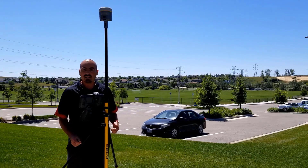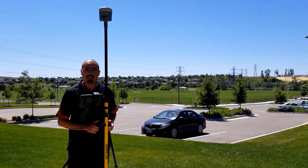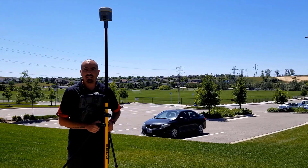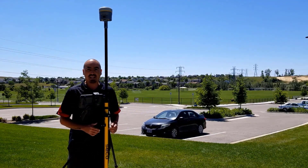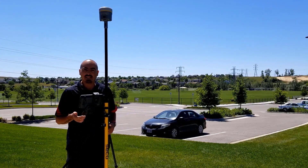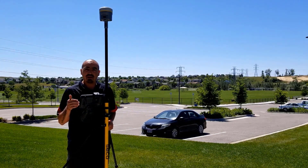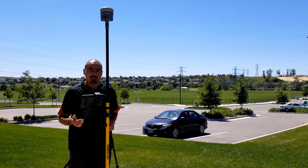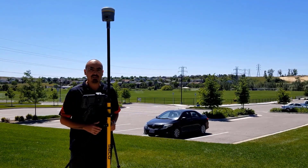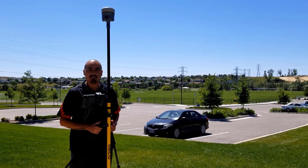Thanks, Bob. My name is Troy Hernandez and I'm in the Arvada, Colorado office. Today we're going to talk about how to do a no-projection, no-datum site calibration with Trimble RTX. Here in Colorado with RTX Fast, we're getting initializations in under 30 seconds consistently — some days within 10 seconds. Through testing that Bob and I have done, we've concluded that we get consistent results as long as the RMS on the vertical is 0.07 — seven hundredths or lower — for consistent vertical shots. That's the sweet spot we've discovered.